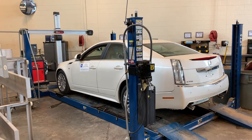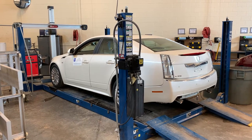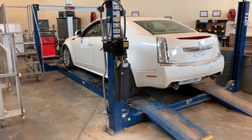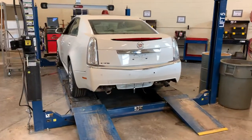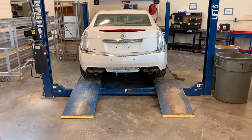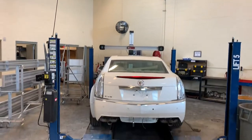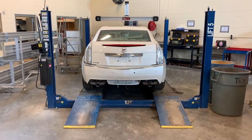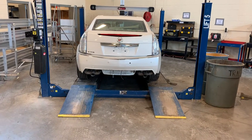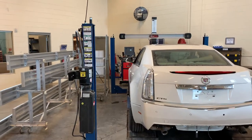So in today's video I'm going to show you how to use one style of four-post hydraulic lift. The nice thing about having a four-post is we're not really worried about center of gravities and things as we drive it on. You just have to center yourself onto the rack here, and most people use a mirror like we have up there on the wall. I like to have that plus someone guiding you, just to make sure we don't drive off the lift, don't get stuck in the middle, and don't have the car sliding off and hitting one of these posts — damaging the car or the lift.